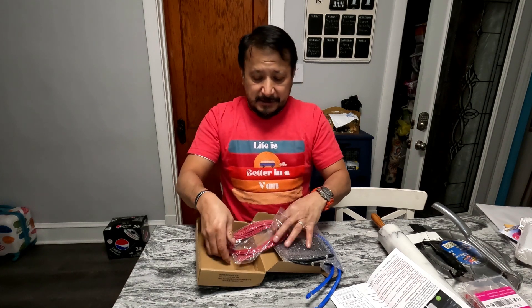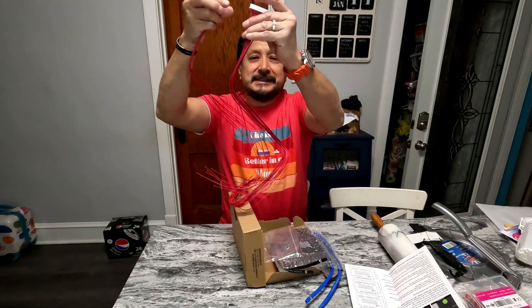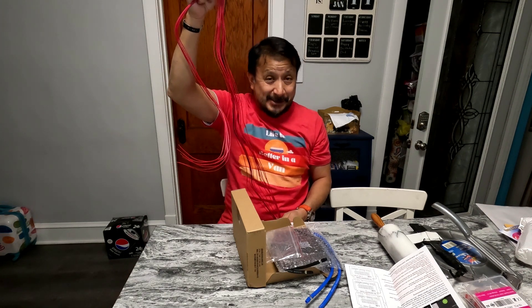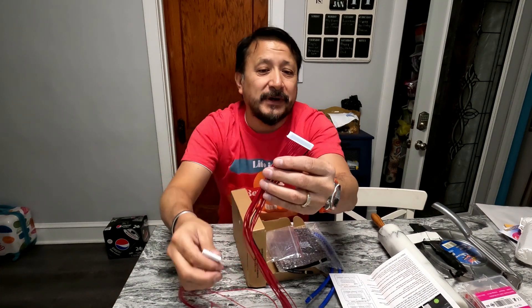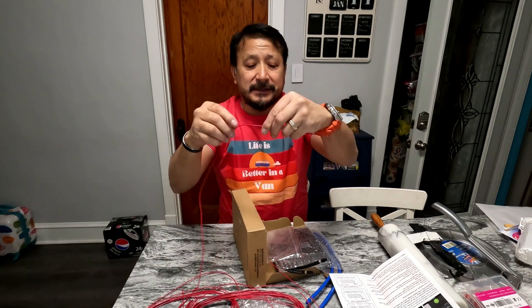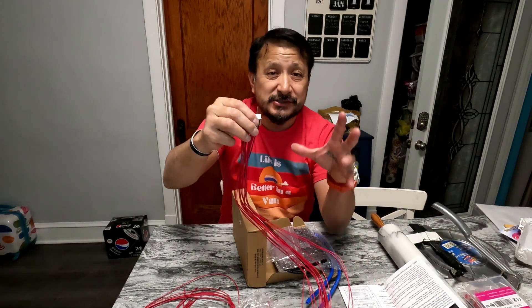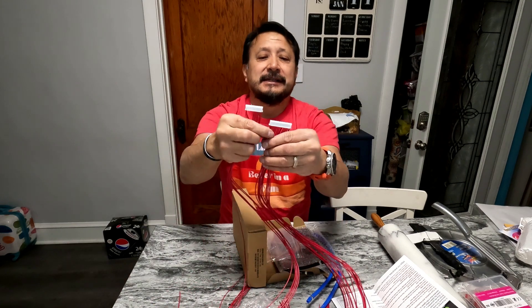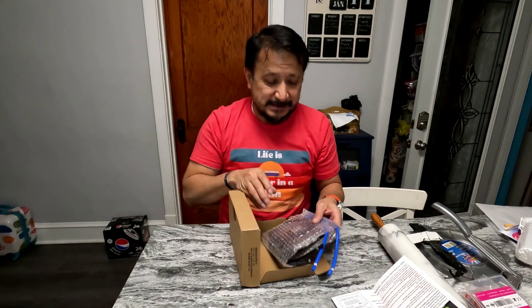I think this one does up to a 24s connection, so there's the balance lead. These balance leads are super long — I've never seen balance leads this long. You have your number one negative, then two, three, four, five. I've got my 14s on the battery right now. I'm going to cut the balance leads and put the little connections together because my batteries are stacked opposite, so from the balance leads I can just connect these, and the 14th one goes to the last string.